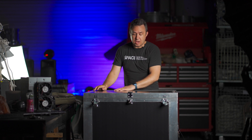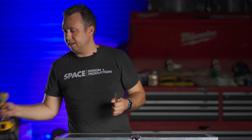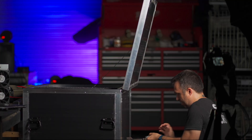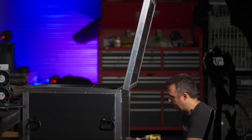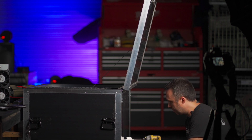When you first receive this thing there's no way into it — there's no port to feed power and data through. So I reached out to Upstream Data and they said you just gotta drill a hole in it. I'm going to use this one-and-a-half inch paddle bit. This box is made from aluminum which is a lot softer than steel, so you can just use a paddle bit or a hole saw to make this hole. The one I used was super old and beat up and actually did a little bit more ripping than cutting.